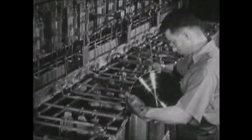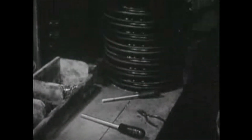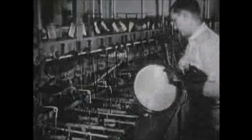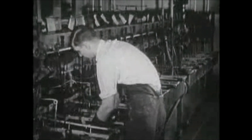The mother matrix is thoroughly washed and cleaned and goes into a nickel bath to give it a more durable surface. After another washing and film coating, it goes into another copper bath where the stamping matrix starts to build up. The double disc bubbles in its bath until the tiny electrified particles of copper grow into a hard, strong coating and the plating is finished.